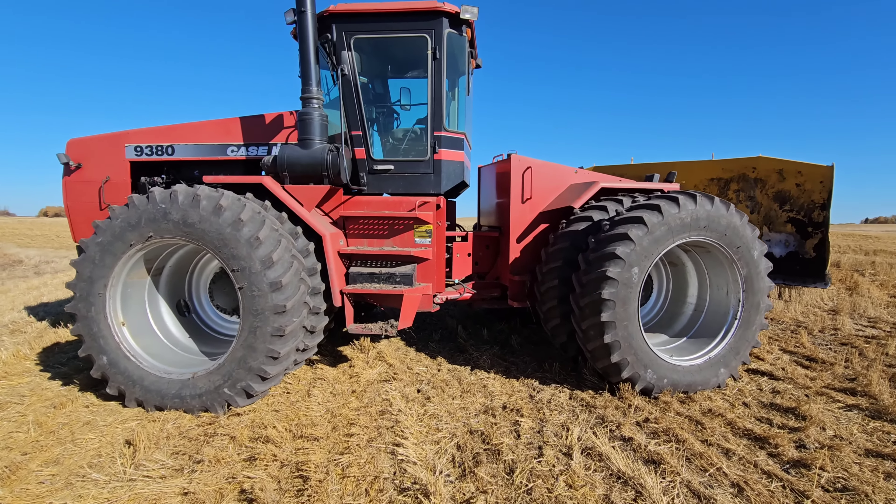I've never hit a line before - never hit a gas line, power line, or telephone line. And I do not intend on starting now. Although we have had to dig holes and trenches and go through them, which means you have to find them. So if we were actually digging in here with the high hoe, we'd be digging, digging, then we'd jump it, come around the other side. We'd maybe take a foot off the top and then we'd be going down with a shovel, or if you had a little extra cash to spend, you could get a hydrovac truck in to locate it for you with water - they would just work their way down to find the line, and then you would dig underneath the line. Now filling your trench back in - same kinds of problems - you've got to fill it in very gently. You can't just plow dirt or you'll rip the line apart. Those are all different sorts of videos - hopefully we do not have to do these.